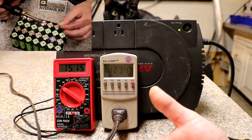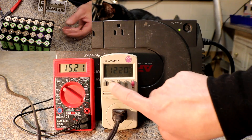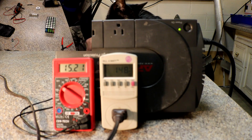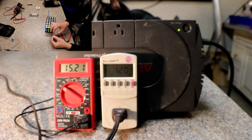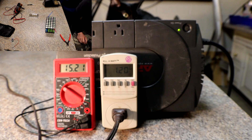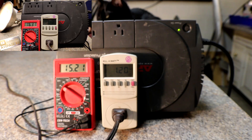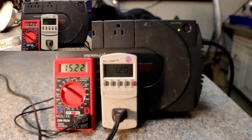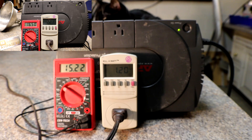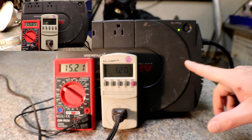Okay, now it's on battery. Right now we're not pulling any power. I have the 100-watt light bulb plugged in — it's off camera so it's not too bright and blinding. I'll go ahead and turn that on. It's pulling 148 watts and 1.2 amps. We'll go ahead and start this test. During the test I'll fast-forward and put a timer on it, and I'll also be randomly taking the temperature of the battery.